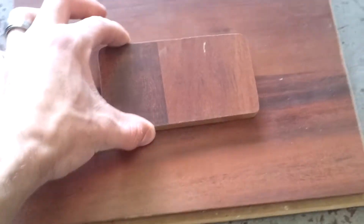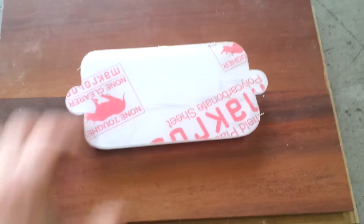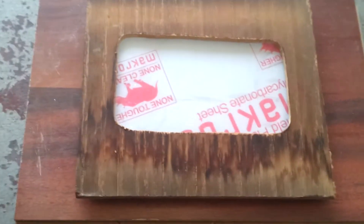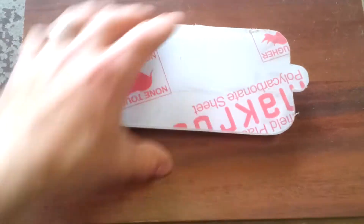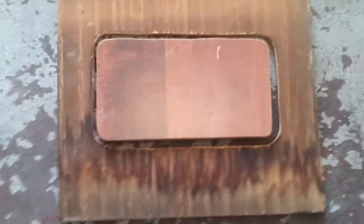What you do is take this piece and put it there, then put your polycarbonate sheet on top of it. You want to take the plastic protective sheeting off both sides first, so it's just the plain polycarbonate. This is designed just a little bit bigger than the mold underneath, and you set it on top with weights on it. As the plastic melts, there's enough space all the way around that it'll allow it to bend and form a nice mold.